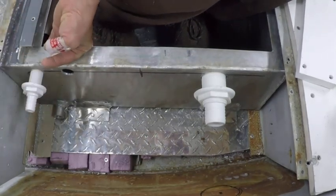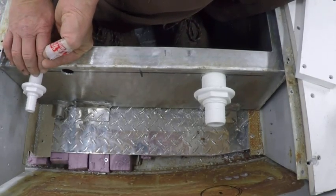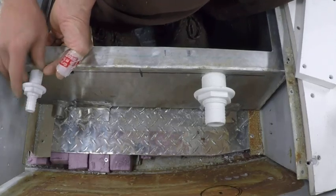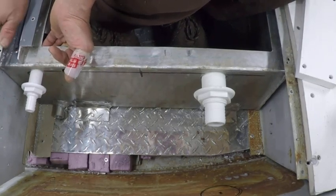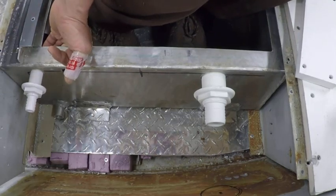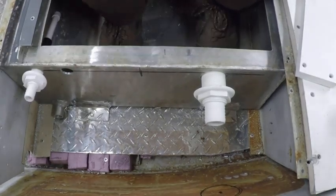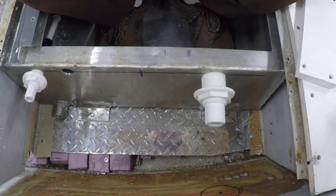We're just going to catch it with a water line coming from the back. It's going to have its own separate pump — no sharing pumps. I've got a 750 gallon pump into this one and a 500 gallon pump into the back one. The reason I went with 750 on this is because it's pumping water about 15 to 16 feet total. That gives it a little extra power to get the water pushed up here and have a little force going into the tank. We've got all the holes drilled. I'm going to go ahead and drill the hole through the side of the boat and we're ready to hook all this up and get the deck finished up 100%.